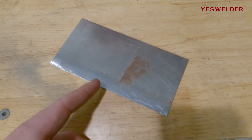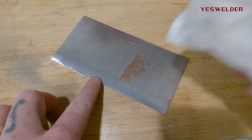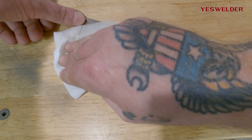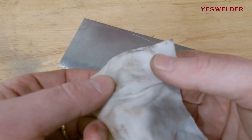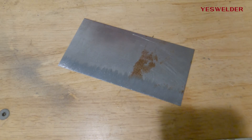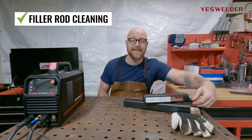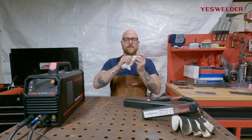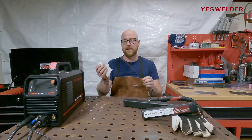Here we've cleaned the edge — no rust, no mill scale — but even though we've done this there are still tiny contaminants on here. We're going to take an acetone rag and wipe it off to make sure it's all clean. We can see there's still a little bit of dirt from the grinding, so cleaning your metal with acetone is a vital step to immediately making those TIG welds better. Lastly, we also want to wipe down the filler rod with acetone — give it a couple wipe downs with that acetone paper towel or rag to make sure it's clean as well.